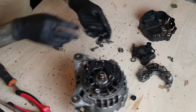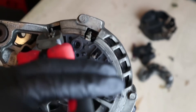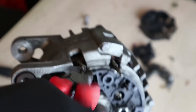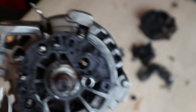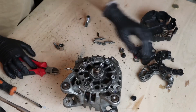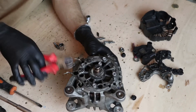Until the cover comes off, you will have the wires exposed. These are the alternator's thickest cables. Instead of cutting them, you need to sever their connection to the alternator. As shown in the video, leave the cables exposed without cutting them. Ensure that only the three or six main cables of the alternator coil are loose when cutting the connections to the remaining cover.